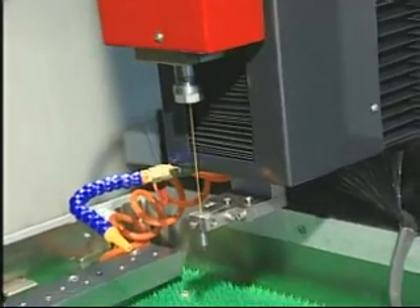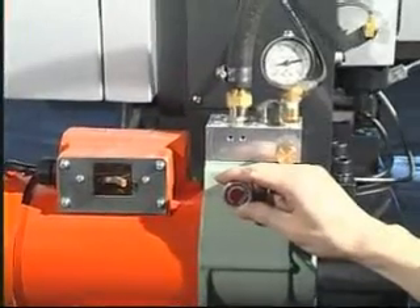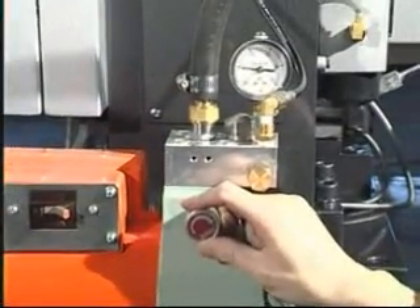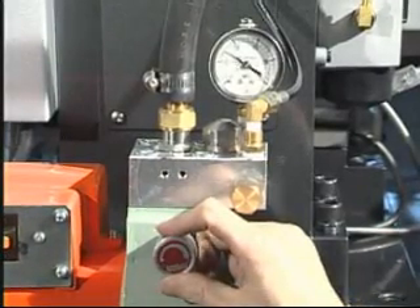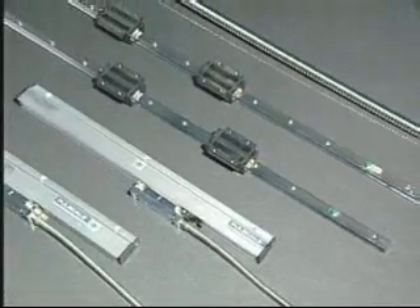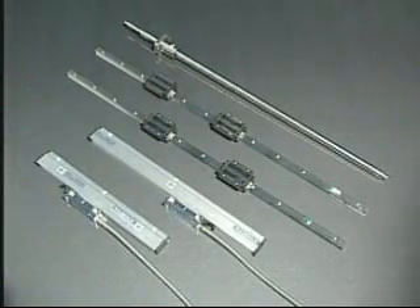TSH-3AA has a submersible stainless water pan, flushing auxiliary pump, and high pressure pump with high efficiency. It takes high precision parts for long term accuracy, such as linear guide and ball screw on Z axis, Japanese pulse scales and servo motor.